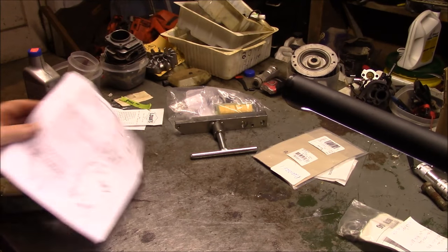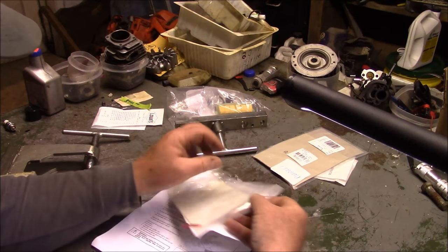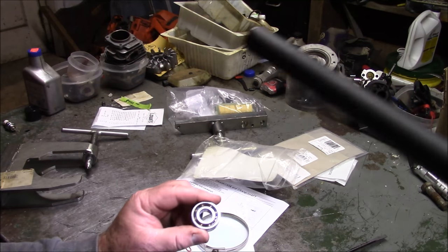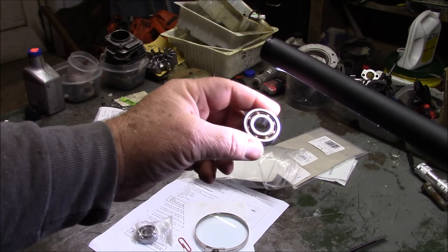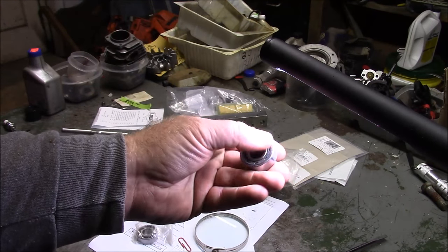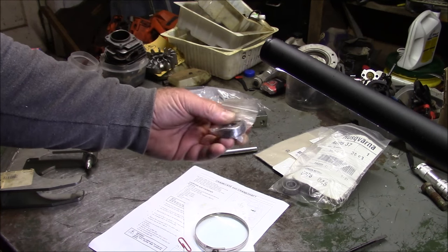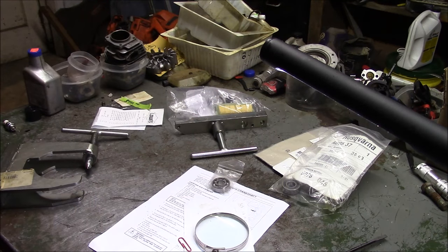The reason why it's interesting to me is: when I ordered an OEM bearing for the case I'm going to repair, this is what I got. You look at this bearing really close — that is a nylon caged bearing, with a seal. That's almost 400 degrees on a nylon caged bearing. So my 250 to 300 degree case temperatures are well below what's going to damage those bearings, at least if you go by their instructions.